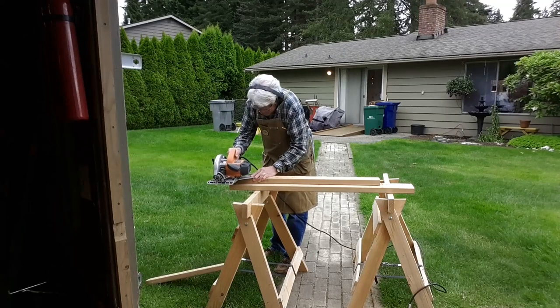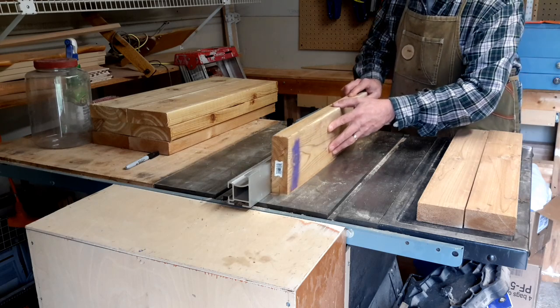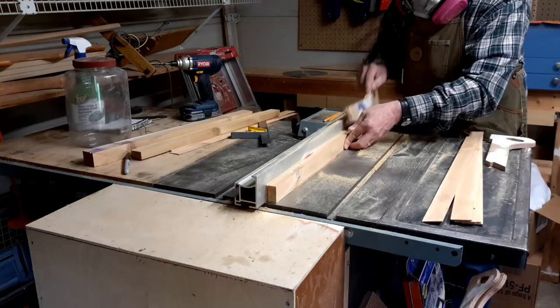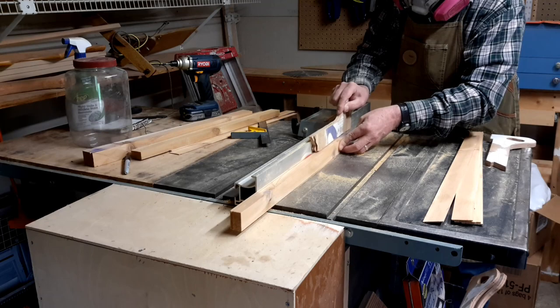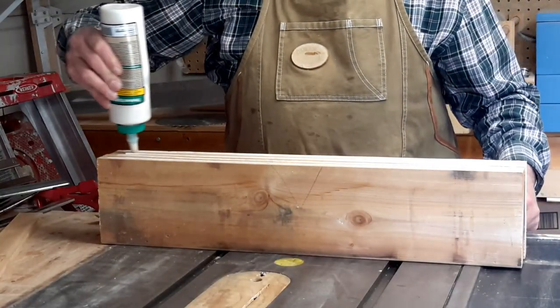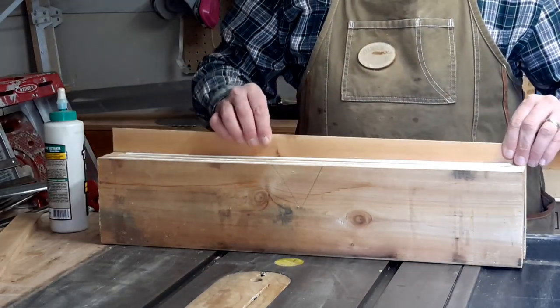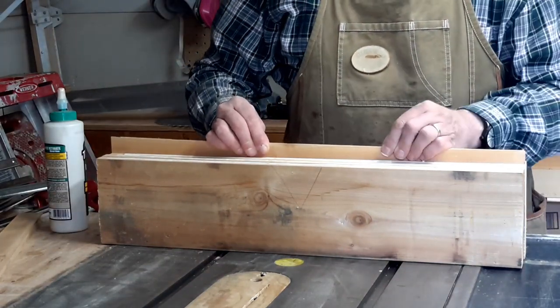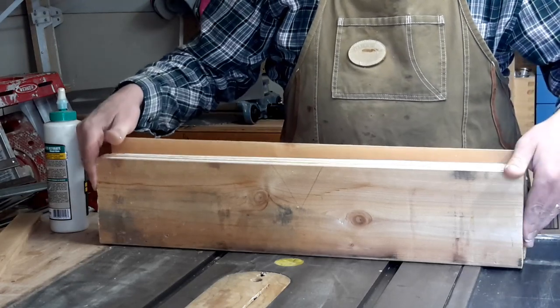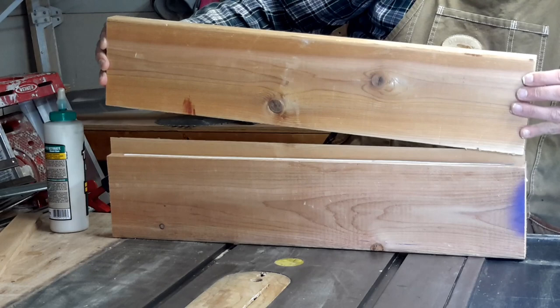It's time to extract the honey from the combs and because we don't have a centrifuge I'm going to make a quick and temporary fruit press. Once we're all done I'll take the press apart and use the wood to make a new bee box. To get the sizes that I need I'm splining the pieces together, which will also give me the strength and uniformity I want, and once they're all done I'll run them to the planer and clean them all up.